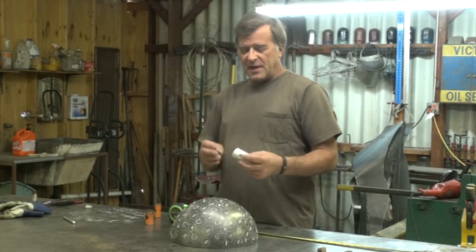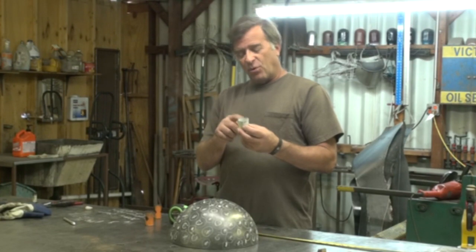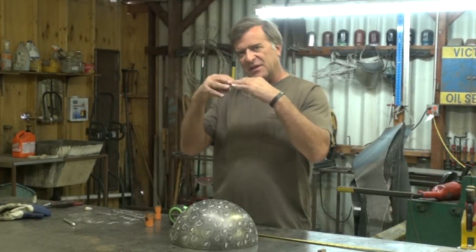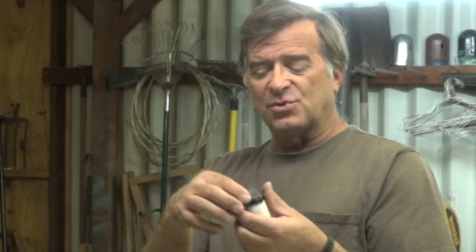Once I have my pipe, I can always orange-peel it — where you cut little slices in it and then bend everything over, weld them all solid, grind them all down smooth. Or I can just get more hemispheres. This is a two-inch and I've got to go by the size that I need, but I'll just weld those right to the tops of the pipes, nice rounded-over smooth edge. That way, when it goes to the powder coater, everything will look just perfect.